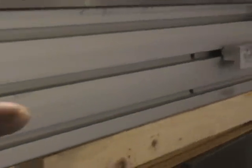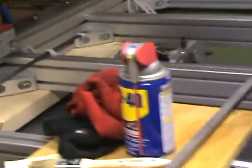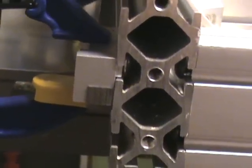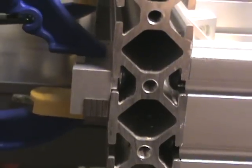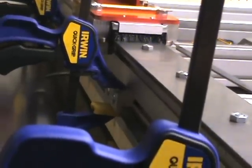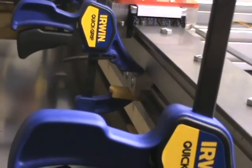Moving on to what we've accomplished: I'm about ready to add the gear rack on this side. I'm mounting the mechanism so the gear pulley faces the front of the machine. The gear rack is mounted basically flush with the end of the machine, and I'll show how I use the clamps to pull the rack up into the rack clamps and finish tightening down the bolts.